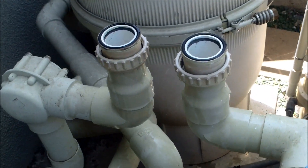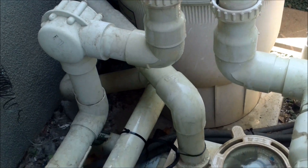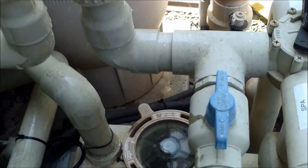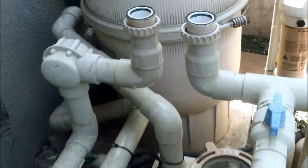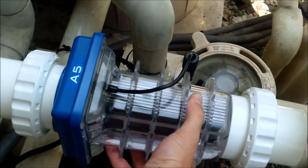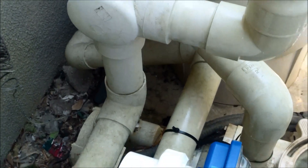The pool already has a salt system and it was plumbed right here, so I'm going to plumb a valley here — taking it off here and over here before the spa. I'm going to bring the salt cell down right about here. The salt cell unit is pretty hefty and large, and I don't have a lot of area to work with in the return area.